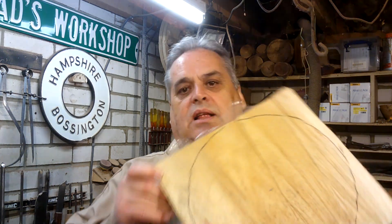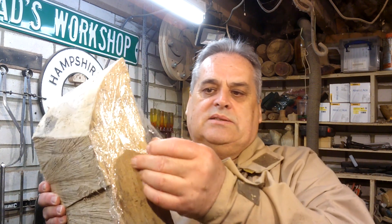I was quite pleased with it - it was a very nice effect at the end. I've got this lovely piece of sycamore, just an off cut of a log. I sealed the ends up - at the time I was undercutting the workshop door and I came across this wood, brought it back and put PVA glue and cling film on that end. It seems to work very nicely because it stopped it splitting. And what I'm going to do is cut it and put some inserts in - I've got some wood here and I think that might be a piece of oak.